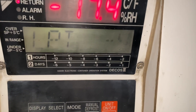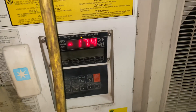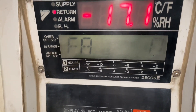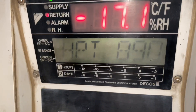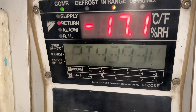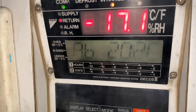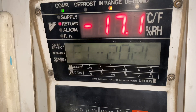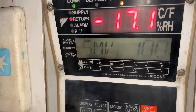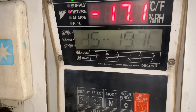To give you a brief familiarization on the unit, let's navigate the controller. Here you will find the HPT which is the high pressure transducer, then the power transformer, the current reading for the current transformer, the ambient temperature, the inlet on the evaporator, the outlet for the evaporator, the discharge temperature after the compressor, the opening of the suction modulation valve, and the opening of your expansion valve.